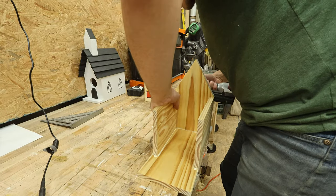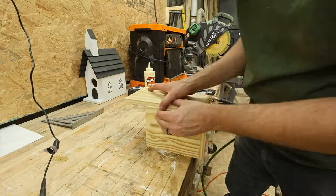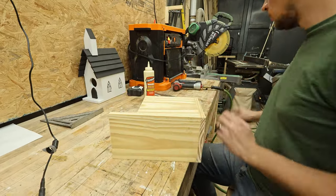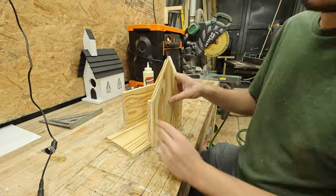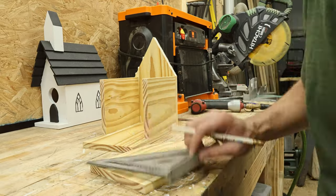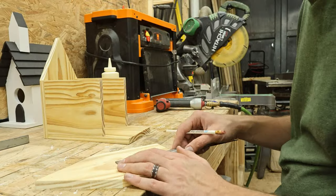One thing I want to point out: the end piece is not sitting on top of the base — the base is butted up against that end piece. The other piece is going to be sitting on top of the base, and I'll show you how we mark for that. You can see the gap doesn't line up, so you just set it beside and use your pencil to mark how tall the base is on that piece, then go cut that. It's a very accurate way to make sure it's correct — you don't have to measure anything.